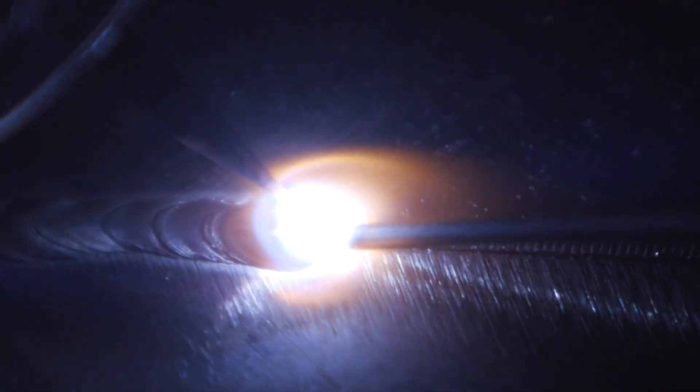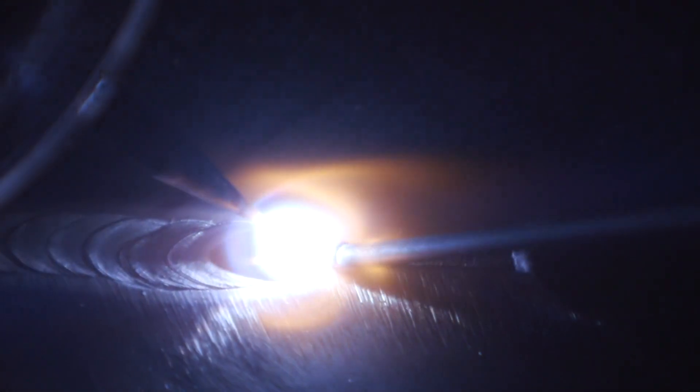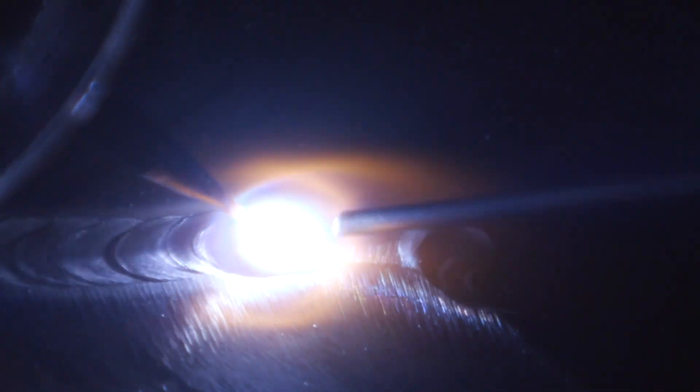Sixteenth-wall tubing tends to act pretty much similar to 16-gauge sheet metal. Keeping the same welding principles, I just control it manually with the foot pedal as I move along.